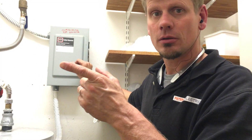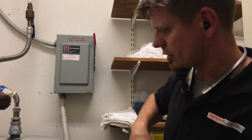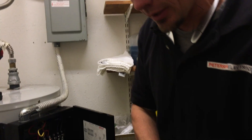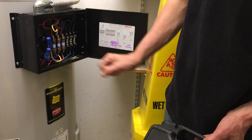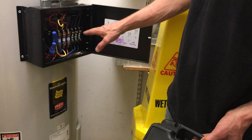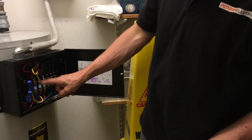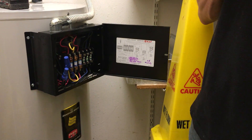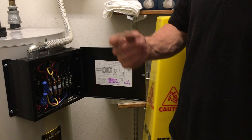Because maybe it's not in the breaker — maybe it's the sub-panel being fed by the main panel. Keeping in mind, it will show itself down here. We did put our Fluke thermal gun on it, and I was reading 150 degrees on this and 125 on this block. As you get a newer block, it's going to have lower temperatures. We are keeping an eye on it. We did see a little temperature difference on these fuses once we popped them in and they warmed up. It did smell a little, but after 30 minutes we realized it was just a burn-off from the oil on the fuse.